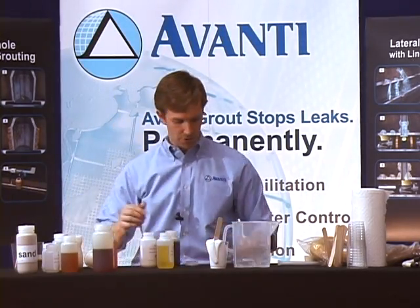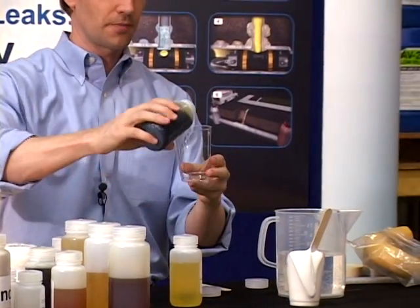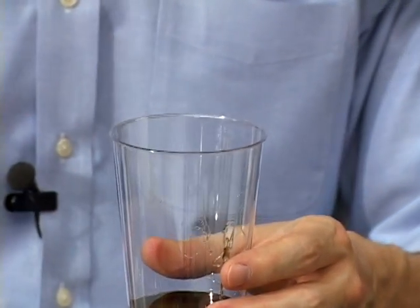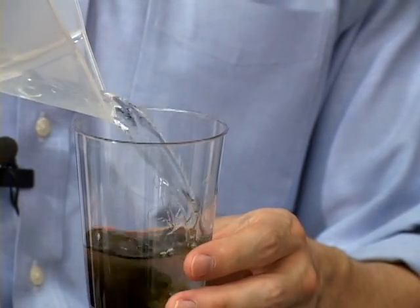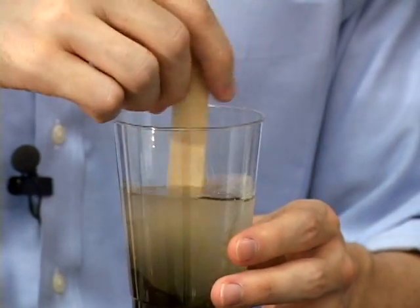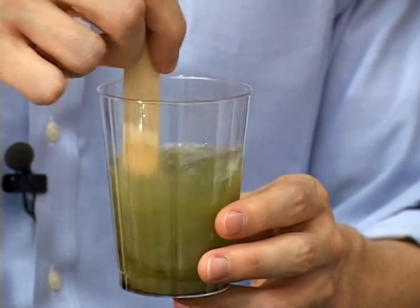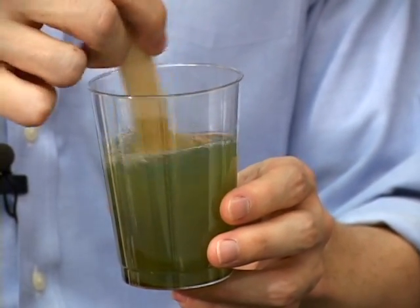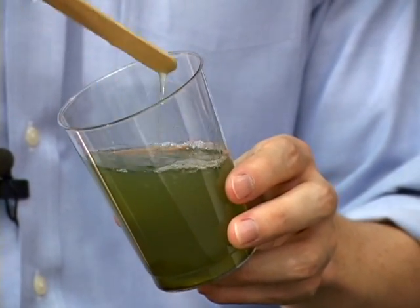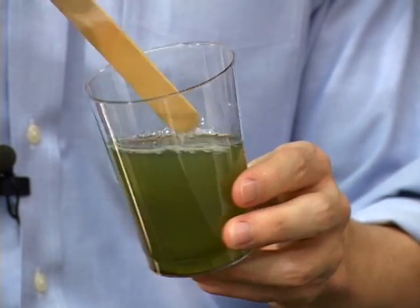I'll show you our AV-350 multi-gel. It's used in exactly the same way, but it's got acetone in it. Some contractors believe that because of the acetone, it helps it to mix with the water faster. So again, I'm pumping it at eight parts water to one part resin. No pre-mixing involved — it just mixes in the soil. You just have to set your pump up at the beginning. It's very thin because it's got so much water in it. Also used for curtain grouting.